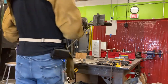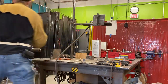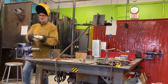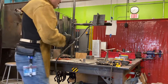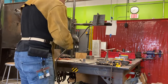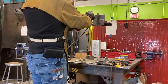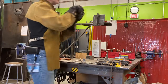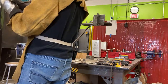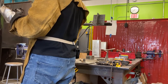So we need to plan our attack very carefully. If I'm welding with a stub rod, a shorter, stubby rod like any one of these two, and I know I'm going to run out of rod in that corner, well, maybe I should choose a different one. Plan it so that maybe I'll stop here, halfway across, tie in there, and then go the rest of the way through. So we need to think strategy. I want you to look at the rods here. Remember, you only get about 6 inches out of this thing. So you know you're going to run out of rod somewhere. We need to think carefully.